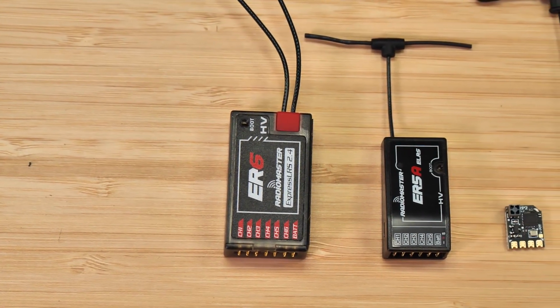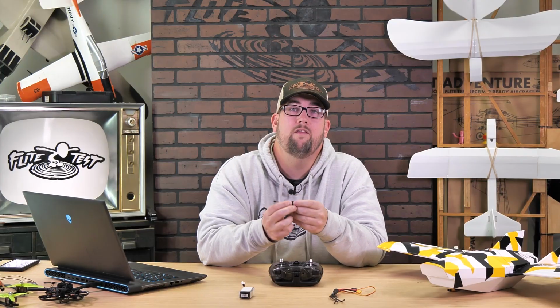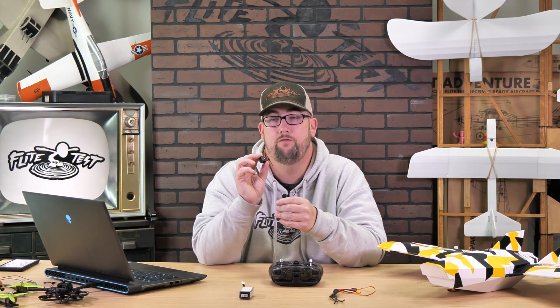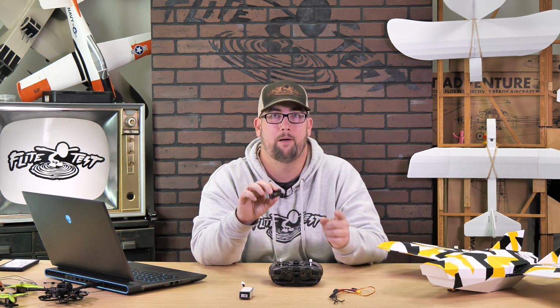I'm Jason, and today I'm going to show you how to set up an Express LRS receiver to work with the Aura Light board. Now in this video, we're going to specifically talk about the Radiomaster ER5A that you can find on the Flight Test store. One of the benefits that I didn't mention in an earlier video is the ability for an Express LRS receiver to output S-Bus, and that's how this will work with the Aura board, and I'm going to show you how to set that up right now.